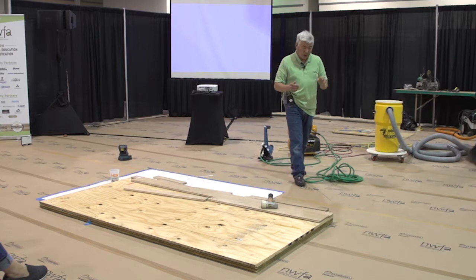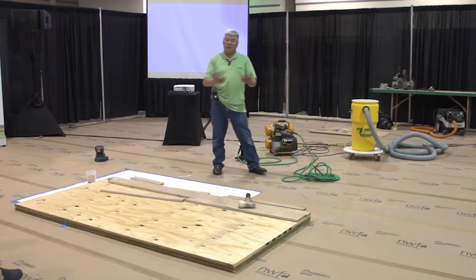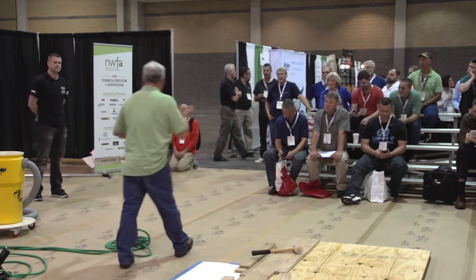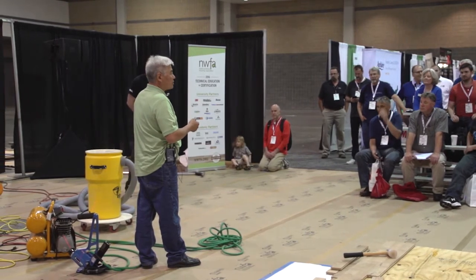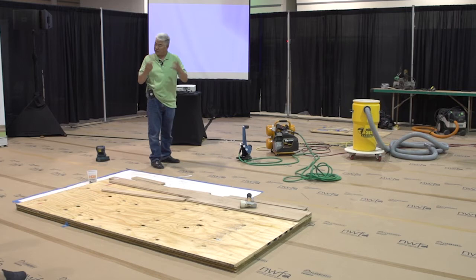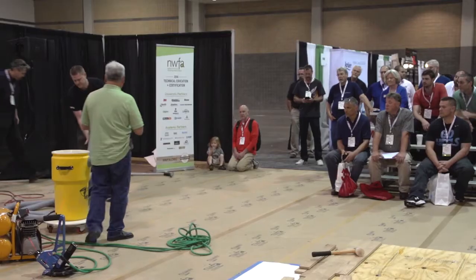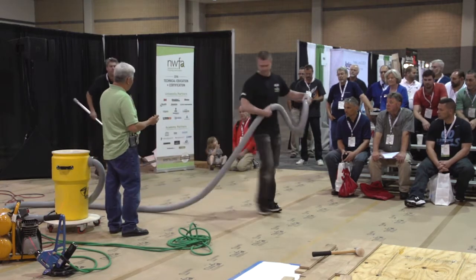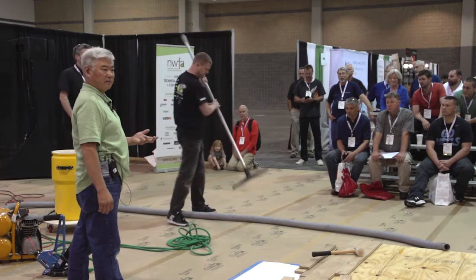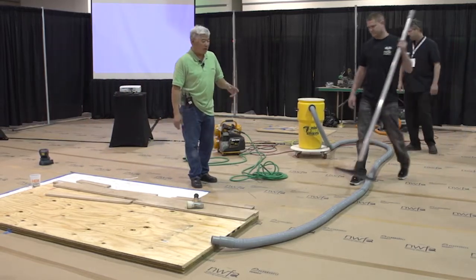So we've installed our floor and done one cut with our sanding machines. Between each sanding, we vacuum. Daniel has come up with a system for a vacuum — it's a little different than what you're seeing on the show floor because this is what we refer to as a brushless motor. There are no brushes. You're hearing that brushless technology a lot in your cordless tools nowadays. That's what he's introduced here. He's got a HEPA vacuum system that's portable. He's got a hose and a wand that's kind of different than what you're used to. Those of you who have used wands before — they tend to have that curve — but notice this wand: it's straight. It's almost like pulling a T-bar.